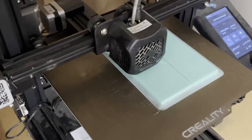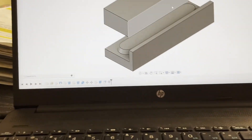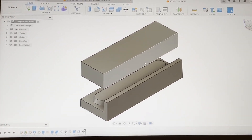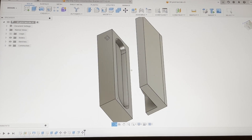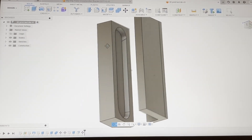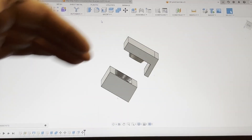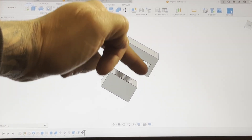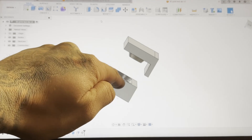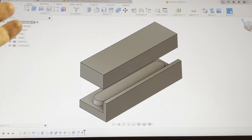On the printer right now we have two different pieces - two halves of this little 3D printed step die that I'm hoping to make successfully. My plan is to press a little oval. I'll be able to butt the panel directly up against this lip here, and I made this lip long enough that it will also act as an alignment tab for the lower die.